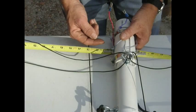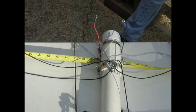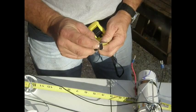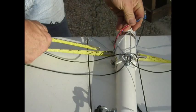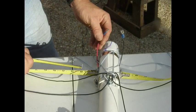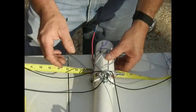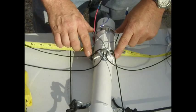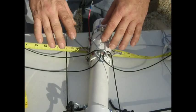Our tape measure at the very end had a slot that was not big enough for the bolt to pass through, so we drilled the hole a little bit larger and filed it out, then fastened it along with the lead to fasten our feed line to. We fabricated these leads, bolted them to the halves of the PVC we made. We did this split PVC type system with two hose clamps mounted to it so that we could move our tape measures up and down on the center support to keep everything level, prevent a pinch in the tape as it came in and out, and ensure it would ride clean and smooth.